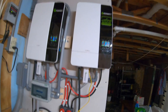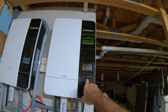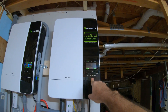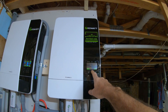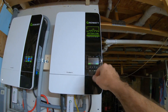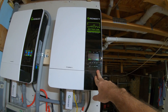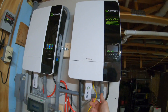There's a setting on the inverter that asks what type of battery you have and how you want to configure it — it has lithium listed as option five. However, I have it set to user-defined, and here's why: clicking lithium to set up the lithium configuration and then manually adjusting the settings doesn't work with these particular batteries. So I went into user-defined, where you can configure the battery cut-in and cut-off points, and that works really well.